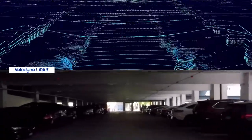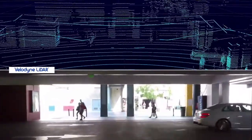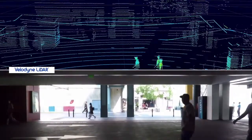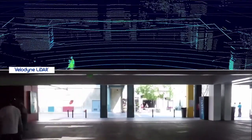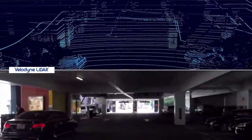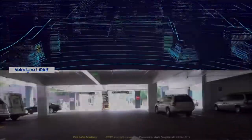Although strictly speaking, LiDARs are not cameras as such, they do act like one and can produce visual images which indicate various distances from the point of view of the device. Because LiDAR uses infrared laser light, like in the 3D laser scanners in survey applications, it achieves high precision of measuring distances with very small powers. LiDAR has become popular in modern autonomous self-driving cars when navigating, but also in drones, which use LiDAR cameras to map and measure terrain below them.